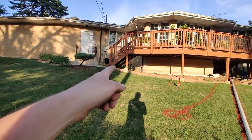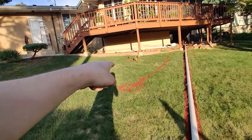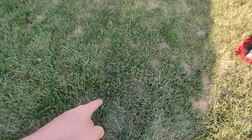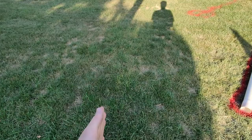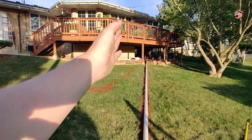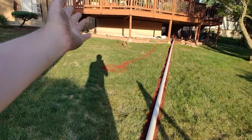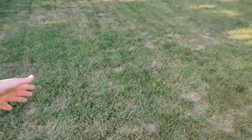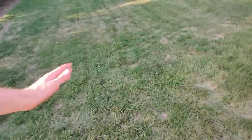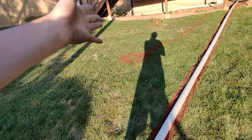There's also that black corrugated pipe over there that comes straight down here and then turns and goes right into that main line — this is the main 6-inch line. That's a 4-inch corrugated. So now I'm going to have this 3-inch line here connect into the 4-inch corrugated. I could connect it to the main line, but there are a lot of Ys and stuff over there, so it'll be more difficult. The corrugated is in good shape — at least it was five years ago.